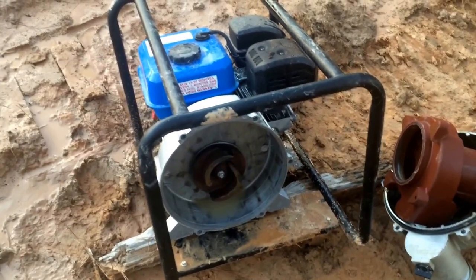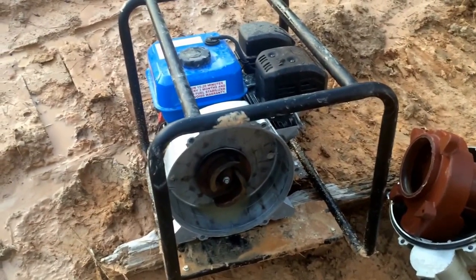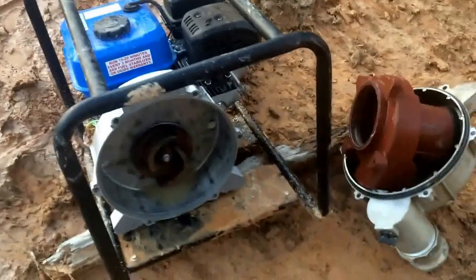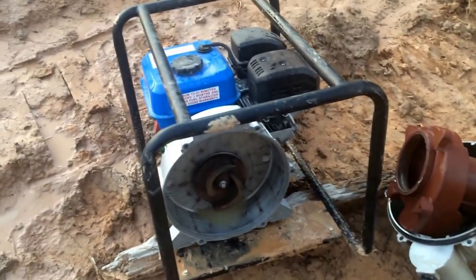Couldn't pull the rope out. This is a brand new pump, so I thought it somehow crapped out and locked up the engine, or else it sucked up something serious in the housing. I opened up all the housing — there's nothing in this pit, no rock, nothing that should suck up through the screen. It's got a suction screen; there's nothing in here that should lock this pump up the way it's designed.